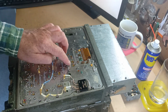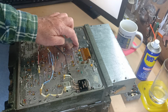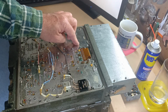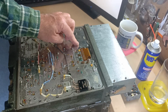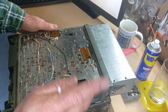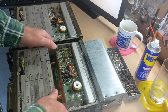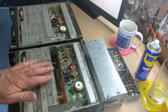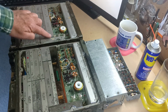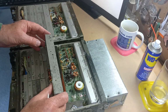And that tells the automatic tuner to stop sending an error message and allow the tuning down to that frequency. Yeah, and it works, and it will start transmitting straight away. However, there's another modification you need to do. If you're going to do that, you need to modify the bandpass filter to allow transmission, so it doesn't start attenuating what you're putting out. So the bandpass filter is this module here, which I've taken out of here, and we have that over here. So that goes in like this.